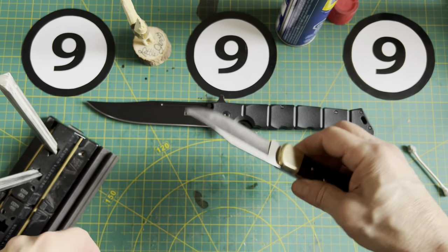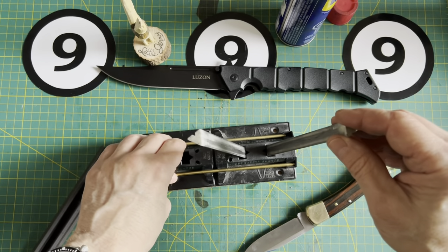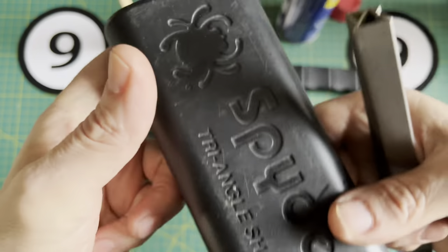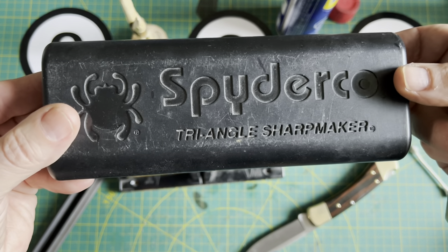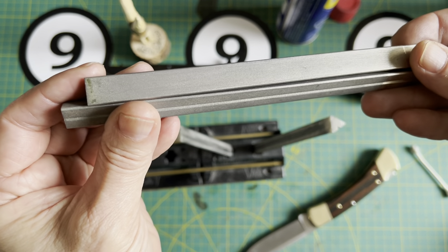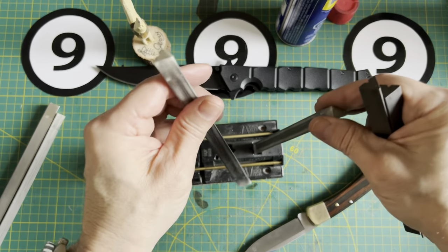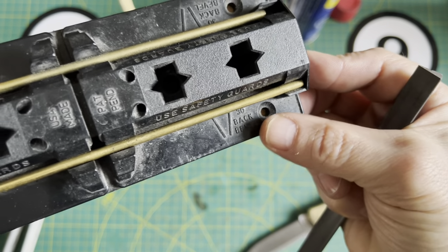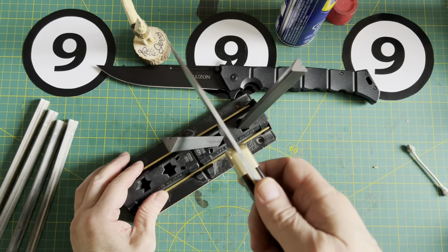We know that the edge is not so good, so let's bring in the Sharpmaker now. Some of you are not going to have a Sharpmaker - this one's by Spyderco. I'm not trying to sell this, I don't work for Spyderco, I'm not a sponsored channel, but this is what I use primarily on my Buck 110. I also have a couple of different types of sharpening methods, but I don't really want to go over those in this one. I've got some diamond-type stones here if I really want to reprofile, but I'm not going to do that. I'm going to go to these ones first and then we'll go to the harder ones last. I am on a 30-degree back bevel, and we'll do it exactly the way Spyderco recommends.